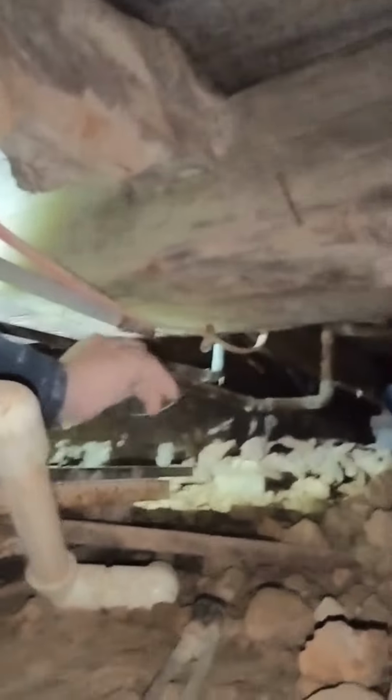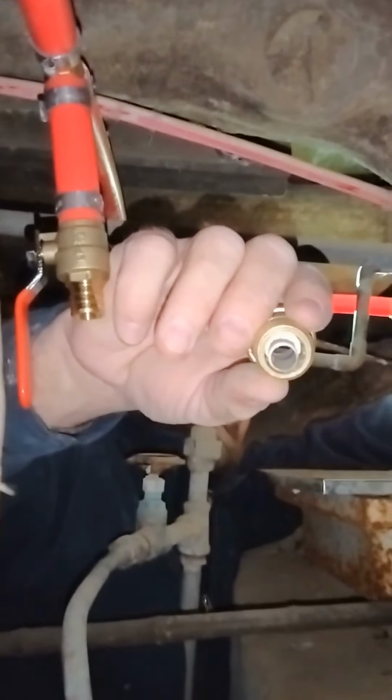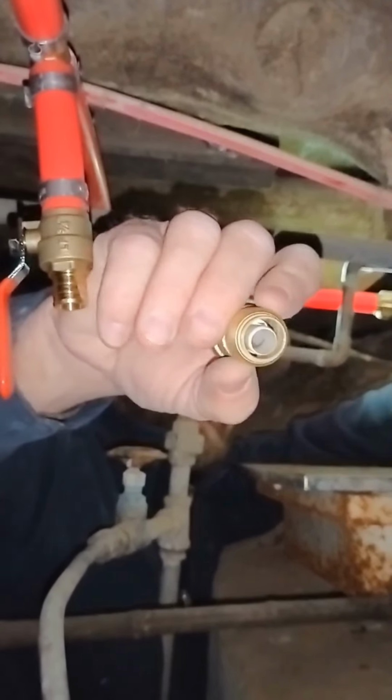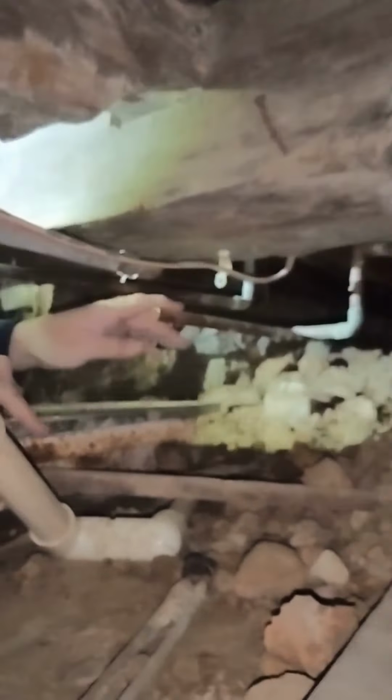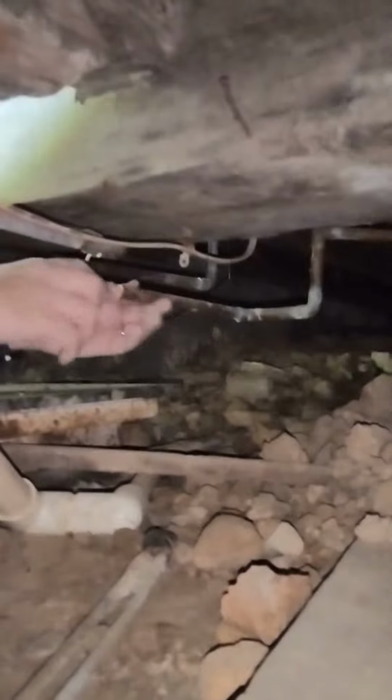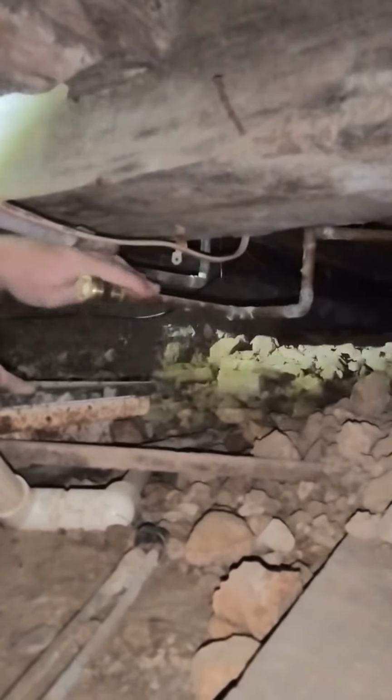So tell us about your fitting while you're putting it together. That's a SharkBite fitting. It's got a collar that slides inside and a crimp that slides over the top. Basically, you just push it on, and it snap locks. They're real quick, and real easy, and kind of expensive. But that way, I don't have to have sweating tools and reach up in here and...